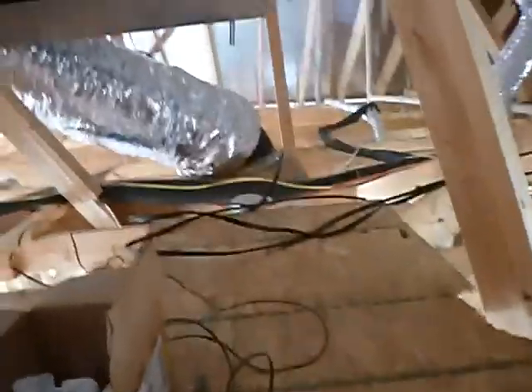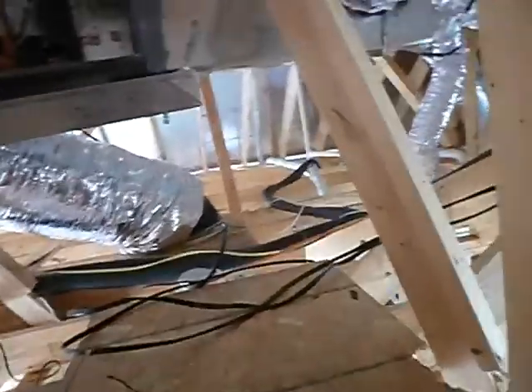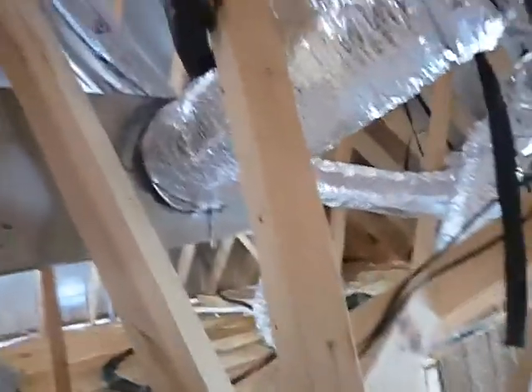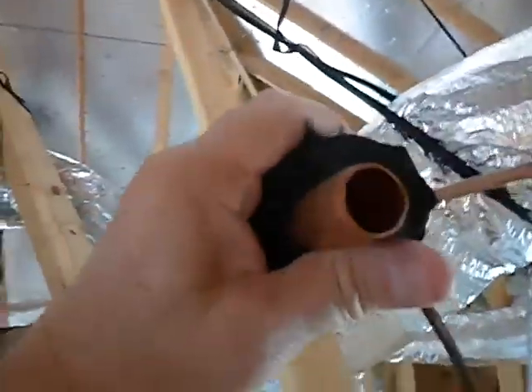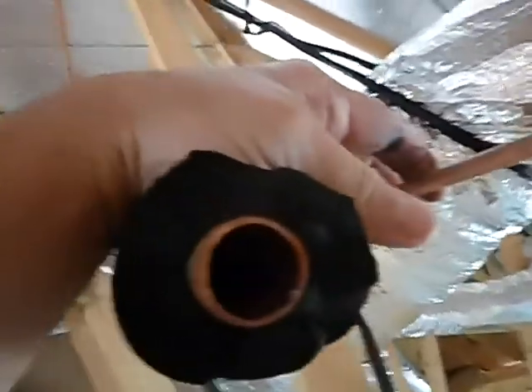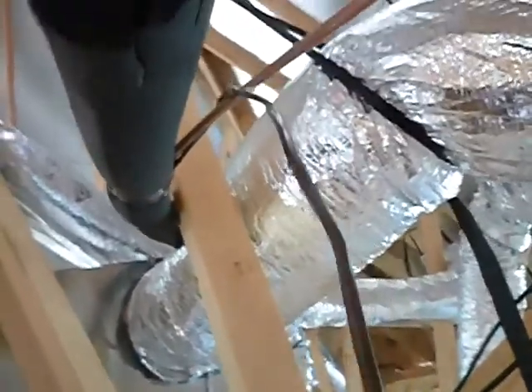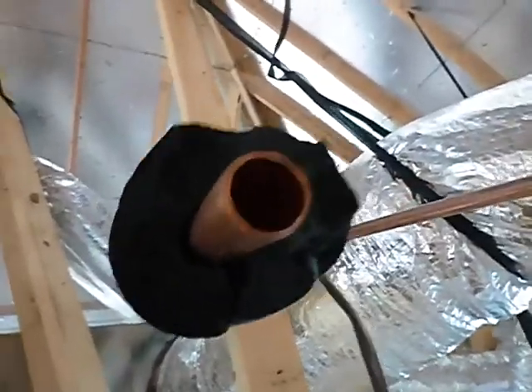We're in the attic. We're going to combine the air conditioning and the attic framing into this one, and we're going to start with the air conditioning. See these refrigerant lines? They're open. There's moisture in air, and they should have been sealed. Because now that they're open, moisture has gotten in all of these lines.